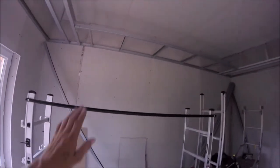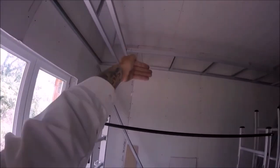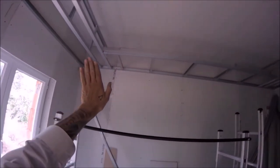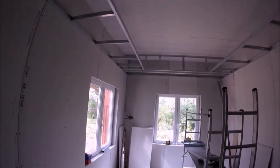That's that done. Now the next thing I'm going to do is build the upstand on this side and that side, which is the same as that. So measuring in 200 from the front or 400 from the back, we'll build a wall the whole way along on both sides, and then that's everything exactly where it should be, ready to move on to the next stage. I really hope that makes sense.